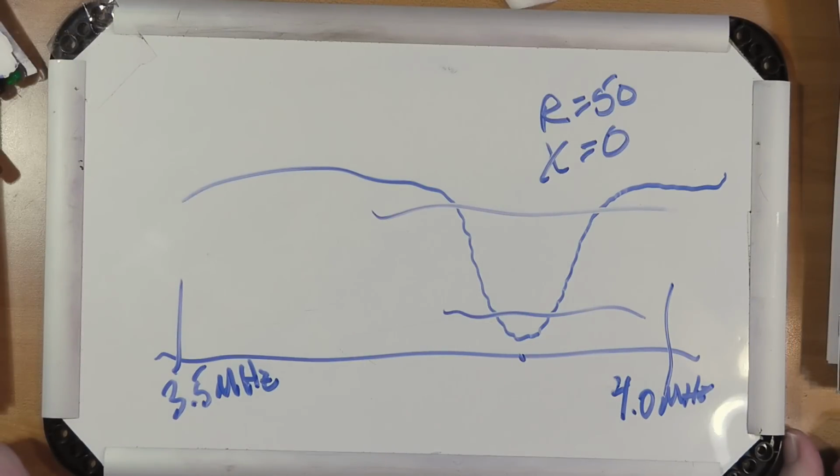Okay, we've gone around in circles on that, and the point I'm trying to make here is that almost all antennas that ham radio operators use are resonant antennas, which means they will only work in a certain bandwidth, and on 80 meters that bandwidth is always quite narrow. So I hope that helps. Tried to give you some ideas of what to do with your 80-meter antenna.